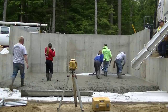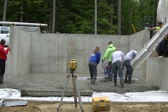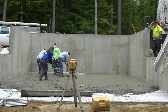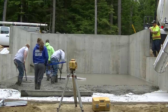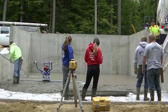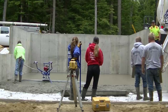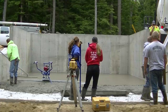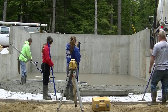Here I am with the vibra screed. What I liked about this vibra screed from Marshalltown is it's set up really nicely — the on/off button and throttle are easy to use, it starts with one pull, and it really vibrates the concrete nice and level. It's kind of like running the Cadillac of vibra screeds. I've run a lot of vibra screeds in the last 39 years, and I would highly recommend this one. It's got a little kickstand on it that helps hold it up, and the handle grips are adjustable up or down depending on how tall you are, making it very comfortable to run.